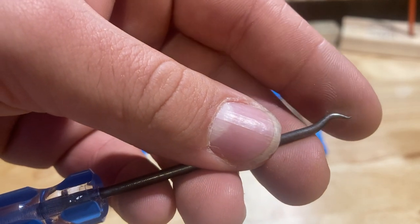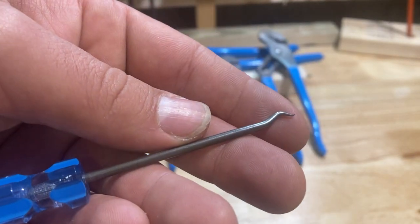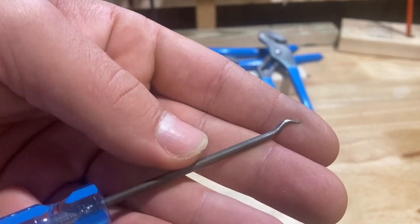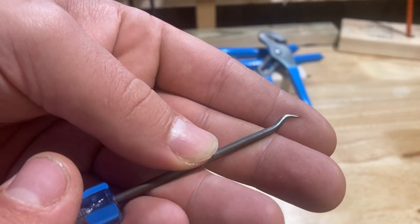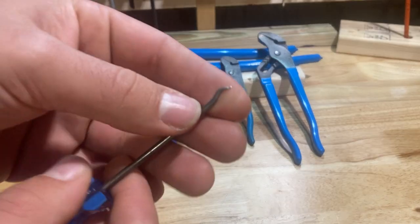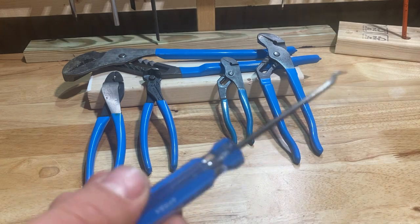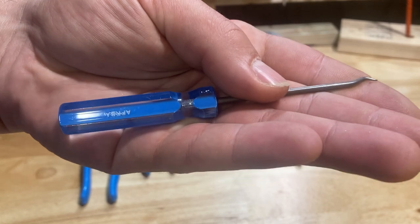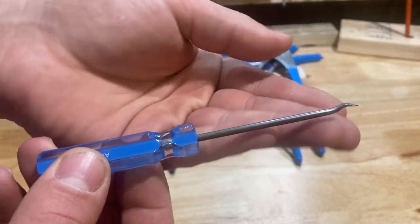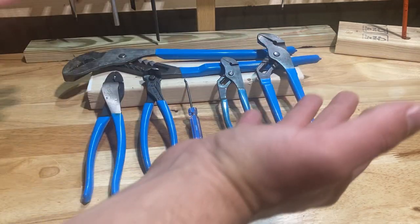Here's a little tiny pick. The bent shape on it — I made it that way by prying on something I shouldn't have. But it ended up being perfect for getting small O-rings out. I work on a certain faucet in a lot of apartments, and I can get much better flow if I take it apart and remove one little O-ring off the cartridge. This pick works great for that because of the extra curve. Channel Lock makes this set of picks in the USA — cheap and better than the Harbor Freight orange ones, though I love those too. This little Channel Lock pick is my favorite.